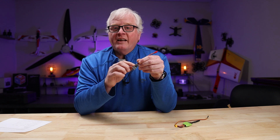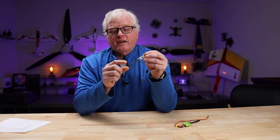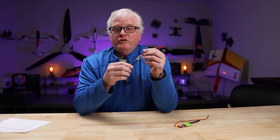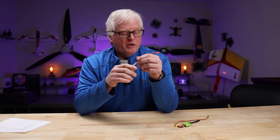One nice thing about this new generation ESC is it's small in size. It only weighs 9 grams without the motor or servo wires. The motor wires are 2mm socket for your bullet connectors. This will run on a 2S LiPo all the way up to a 6S LiPo. It's very efficient for high KV motors.